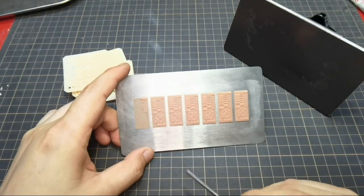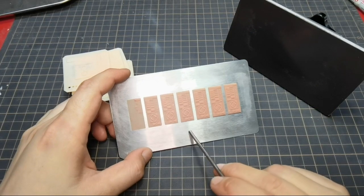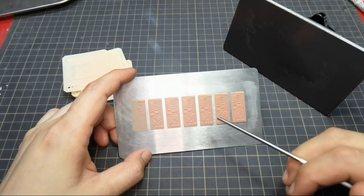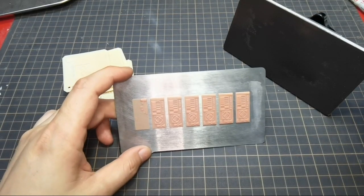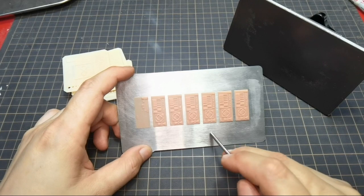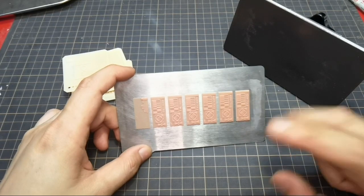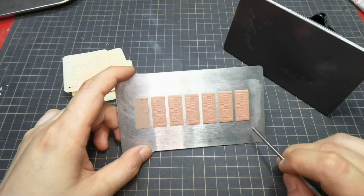So you've seen the difference between the Anycubic RERF and this multiple exposure finder. I made this exposure finder using software called UVTools — it is a very awesome software. You can repair your files, check for any overhangs that you forgot to support, and many other cool functions. Honestly I barely scratched the surface. I put a link in the description if you want to download it, and maybe donate to the developer because they made such an awesome software. I also put a link in the description if you want to download this exposure finder — I made two files: one at 30 micron Z height and another at 50 micron Z height.